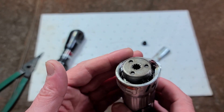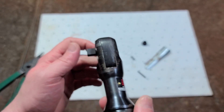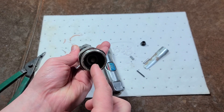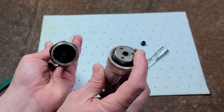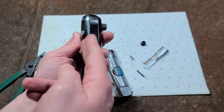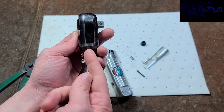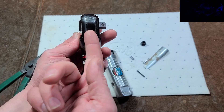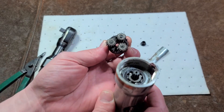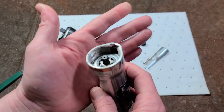So this is the whole vane motor and gear reduction. There is a gear reduction because air ratchets work like a normal ratchet — they just have super heavy-duty pawls inside. There's a splined shaft that the output of the gearbox drives. That shaft goes up through here and there's a piece that wobbles back and forth — the same as you using your hand to turn the ratchet. There's just a little plate with a pin that spins around and moves this thing back and forth. The vane motor drives a simple three-gear planetary gearbox.